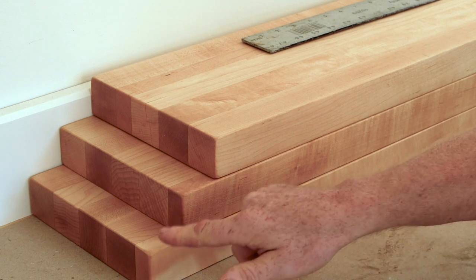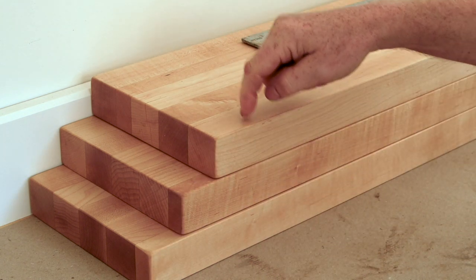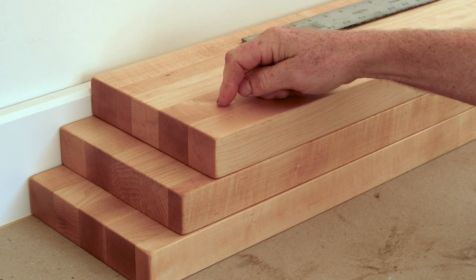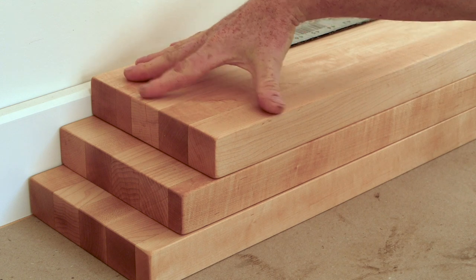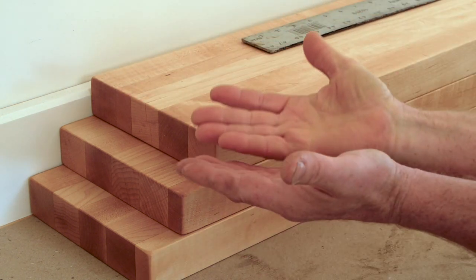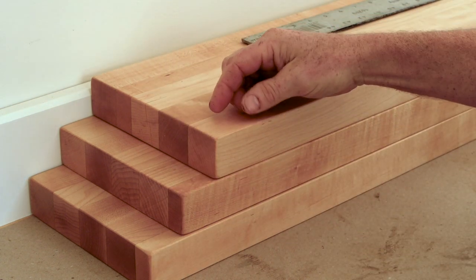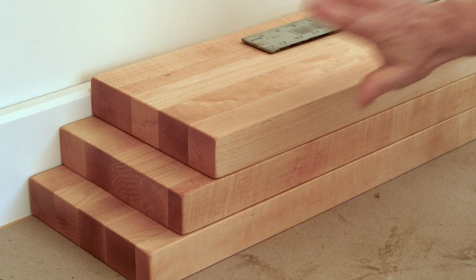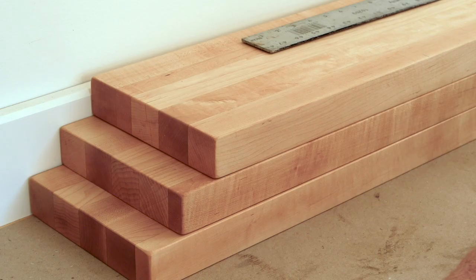The shelves we're installing are pretty nice — laminated hard maple left over from the countertops we built for the tiny house. You could do this with solid wood; I've even built these out of dimensional lumber and they're plenty stable up to about eight inches wide, after which you want to start considering laminations. I've also done this with live edge boards, which has a really nice look. It's really whatever you want for your particular shelf.